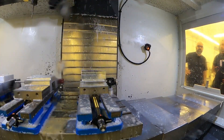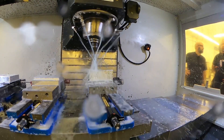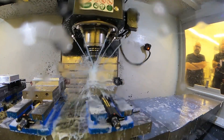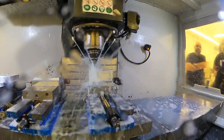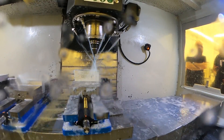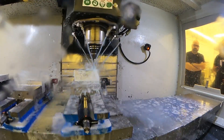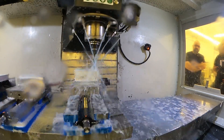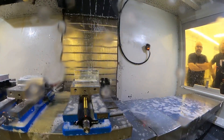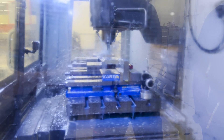We should be doing all the drilling and then we'll go with the taps. These are the holes that actually bolt the heat plates in - it's drilling them and then it's going to come down and tap as well. It'll drill all the holes first - the M4 holes, then the heater hole - and then it goes and taps everything. Now it's actually tapping, which is threading the actual holes so that the screw can go in the hole.